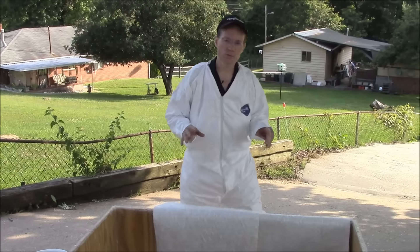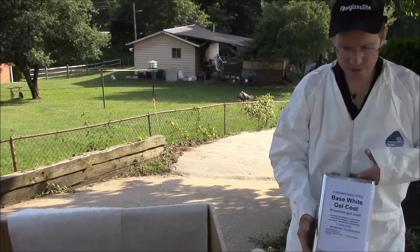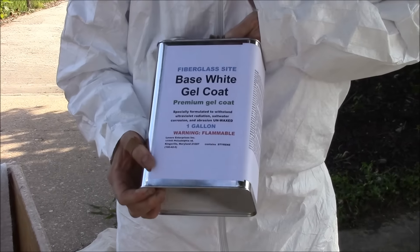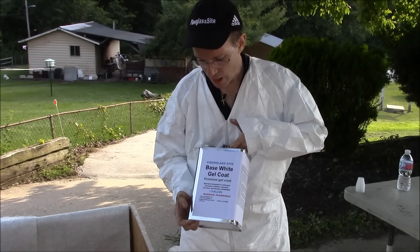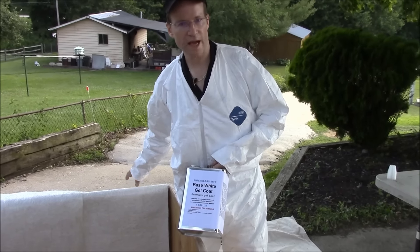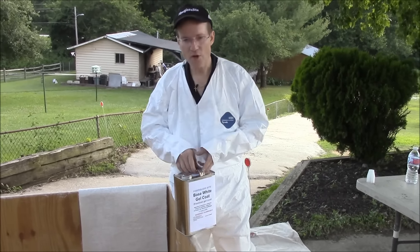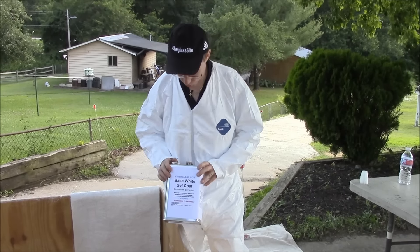Now you're going to do your gel coat. Here's the gel coat that we use — you can feel the weight of this. If you go to any boating supply store, you're going to get consumer grade gel coat. This is professional grade gel coat, 10 pounds per gallon. It has much more solids in it and nothing is going to get through this — not chemicals, not anything. For the first layer, you can thin it down 10 to 15% with acetone. Always use hardener. Never ever use polyester resin or gel coat without hardener.